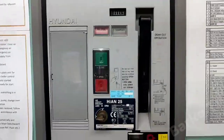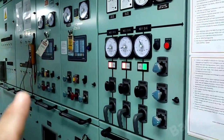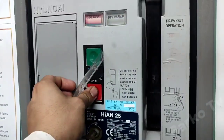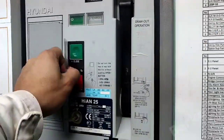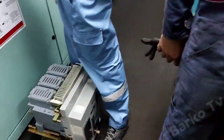This is the bus tie. Bus tie is isolated from number one — number one generator. We need to turn off two and three because they are connected. The bus tie of two and three is connected, including the number two group panel. We need to open two and three generator, including the group feeder panel. Number two is isolated.